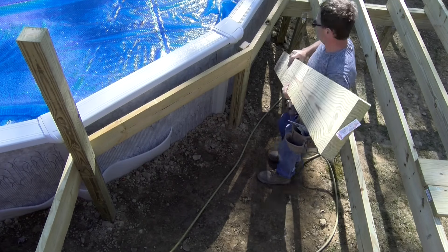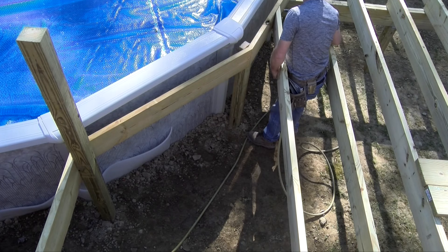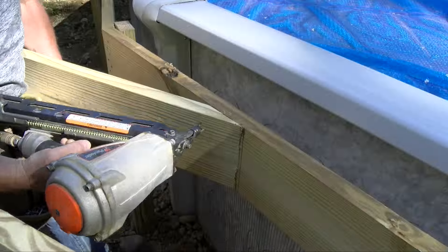This 2x8 joist end is cut by hand at a pretty aggressive 60-degree angle to fit the poolside. The rest of the joists go in the same way and are held in by these adjustable 2x8 brackets. The last and final bracket — the old 2x8 joist hanger — is put on all the ends of the joists we installed earlier.